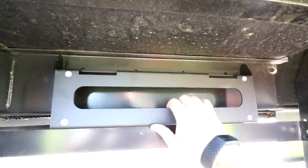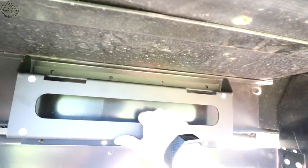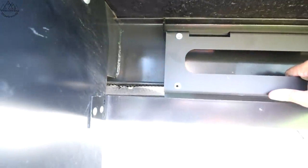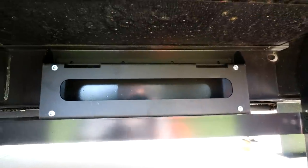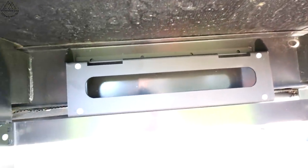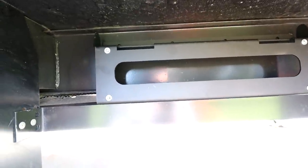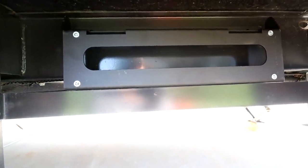Here's the hillbilly hack issue: the bracket is just too wide for the 6-inch I-beam. The bracket is supposed to bump all the way up against the top of the I-beam, and those four holes up top are meant to drill and screw into the beam. But my I-beam is a little short. So what I'm going to do is attach the top four holes with the provided hardware to my I-beam, then self-tap into this spot and this spot on the existing bracket. The other one is already solid as a rock.